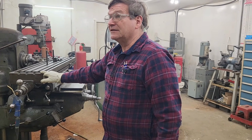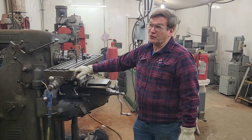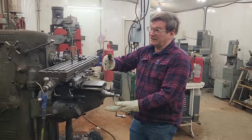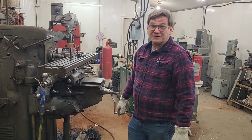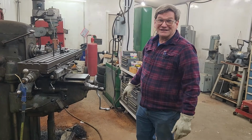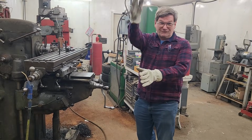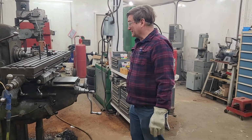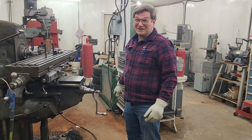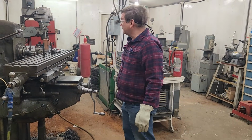And I did one some years back with a set of forklift forks. They were 10 inches wide, I think. I had to take, I don't remember, a half inch or something off of them, 8 foot long. Not huge. I've actually worked with some bigger ones since, and in fact, we've taken bigger ones. We've got a saw set up so we can rip saw to thin down forklift forks. It's demoted since we got the new saw, but we've still kept it because it's kind of a handy thing to be able to do a long rip sawing operation.